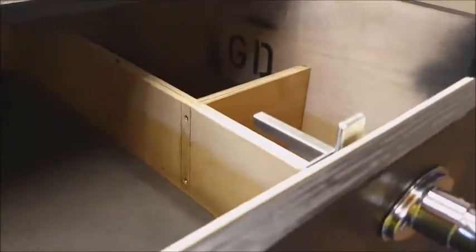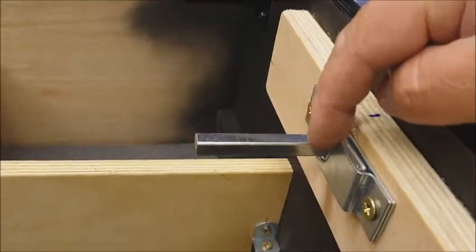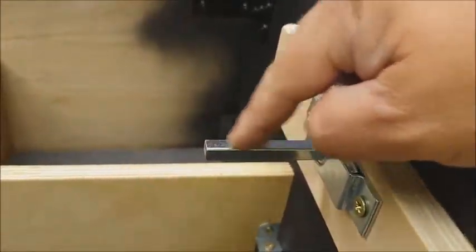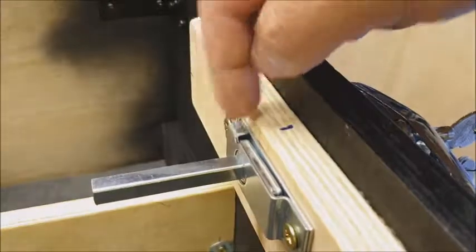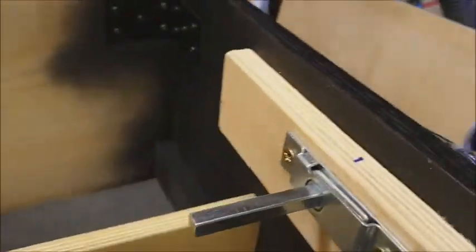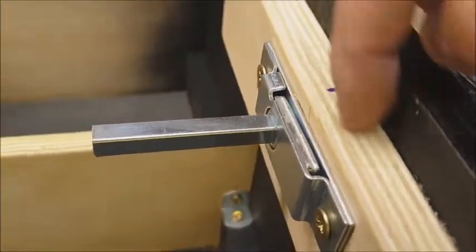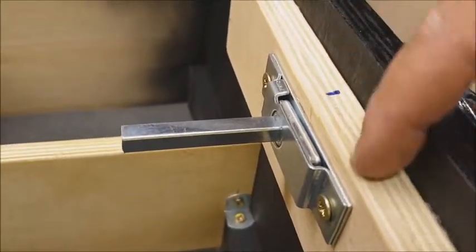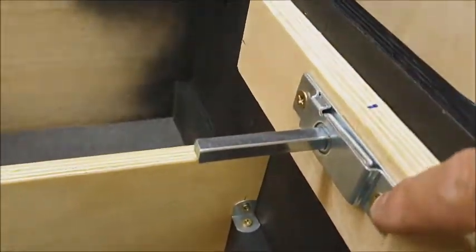I've got to move that back around. I've got to take it all back off, so when it's shut the handle will be like that when it's locked. But it's just put on temporary at the moment because I've got to take all the lock back off to cut this spare bit off. I don't need that. But the 2 bolts that went in the back to hold the T-handle in, I've had to recess them because of this sitting on here. So I've recessed them into this spare bit of wood I've put on there and put 2 washers on them. So they're done up behind here.